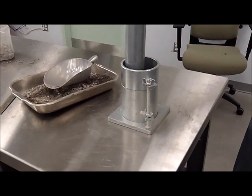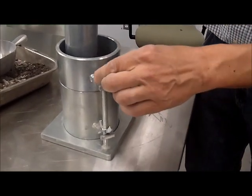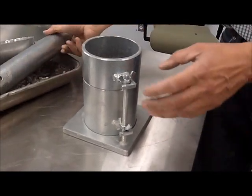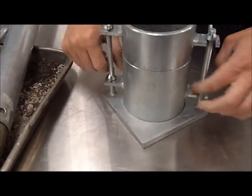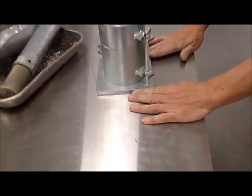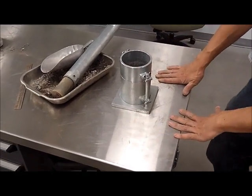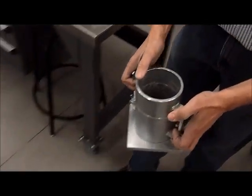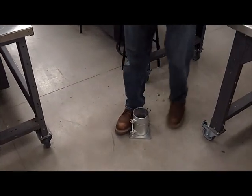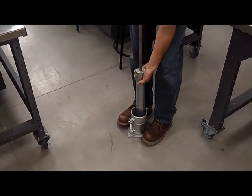Something I'm doing wrong here is quite evident by the noise that you hear. First of all, the test equipment hasn't been tied properly, which means the collar is loose. Also, I'm compacting not using a very stiff subgrade. This, in spite of being metal, is not as sturdy as if we were doing the compaction process on a stiff concrete surface, and you're going to appreciate that with the difference in sound.